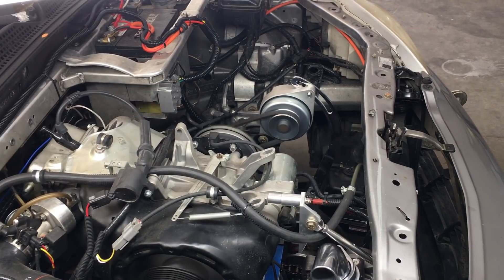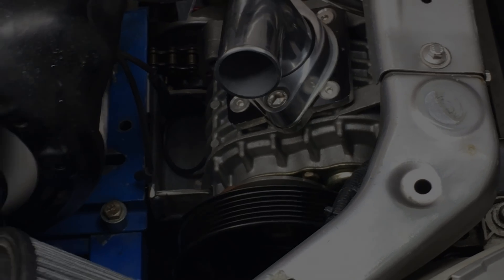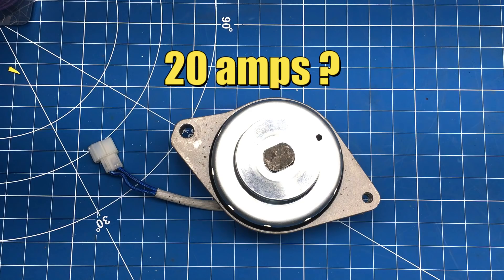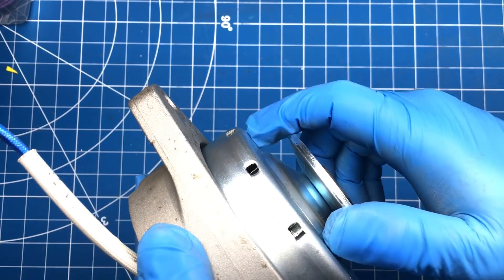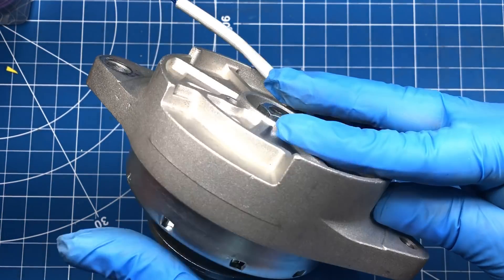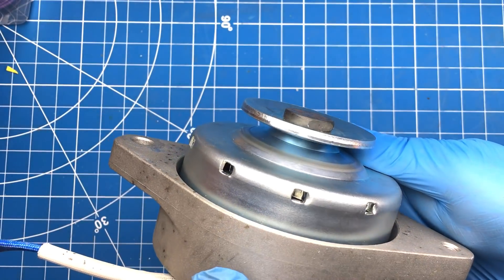The placement of the alternator is somewhat awkward, and that's because we're reserving the flywheel side of the engine to drive the charger — but that's a story for another day. This is the Mini Alternator. As I recall, the original application was for a John Deere tractor of some sort. According to the propaganda, these little alternators are good for a maximum of 20 amps. What makes this alternator unique and more suitable for our application is that it operates with permanent magnets instead of field windings.